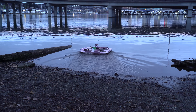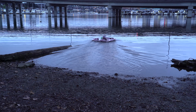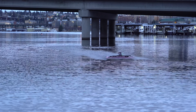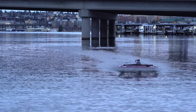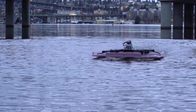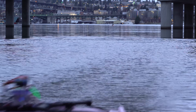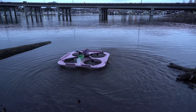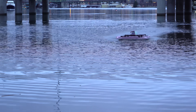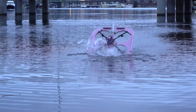The thruster motor definitely helped it accelerate faster, which is all fine and good until you get going too fast and it goes aerodynamically unstable and starts acting like a bucking bronco. This is probably because the CG is in the middle like a drone, not at 20 or 30% back from the leading edge like an airplane. So this thing is not going to be able to glide like an airplane at all — the aerodynamic forces are actively trying to flip it over, and the quadcopter flight controller has to work extra hard to keep it upright.